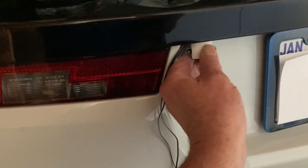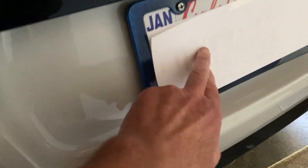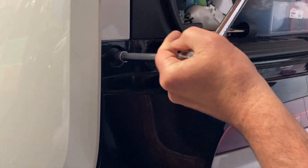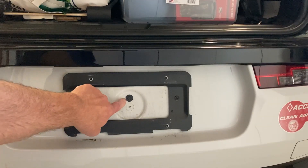The plan is to mount the small electric buzzer about here on the car, but to do that I need to pull out the bumper to wire it up to the reverse light power supply — so whenever the car goes in reverse it'll turn on the buzzer. It looks like you have to remove the screw on both sides, the screw in the center, and several screws down in this region, then unclip the clips that attach the side piece to the bumper. It's an eight-millimeter screw — a quick ratchet and it comes out pretty easily.